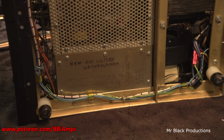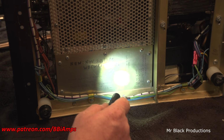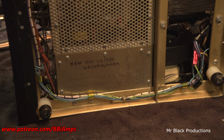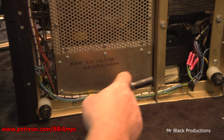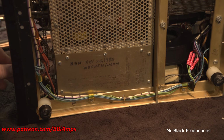And I admire this because I know exactly where to start, what to go look at. So I know that the blower hasn't been lubed for 8 years, and that all effective maintenance stopped in 2015. So this thing hasn't had any love for over 8 years, is the long and the short of it. As I start to look around, I recognize I'm going to have to rewire some of this stuff, like all these butt splices. Like I said, those leads run around and attach to the switch that's up here on the front.